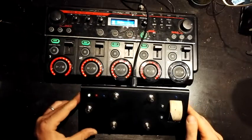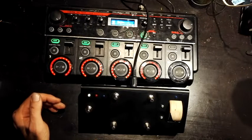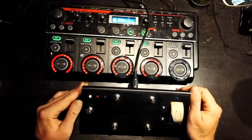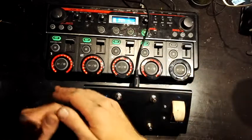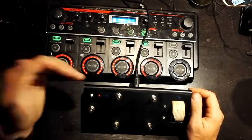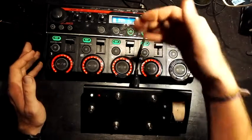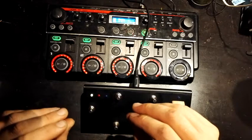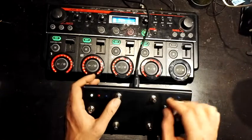It's important to say that this is not like the all start, all stop button, because the looper does not have the capability to understand too many signals at the same time. So as I wrote the code for the pedal, I had to make a little time pause between the information I sent, and I can give the looper, I think, up to 16 or 17 informations that it will really be translating to the looper, but it will always be a sequence in time also. It's not like the start all and all stop. I can demonstrate with an example.